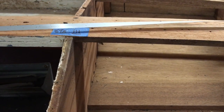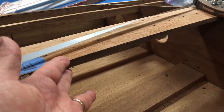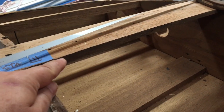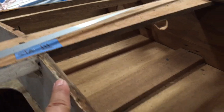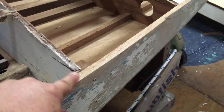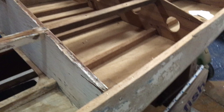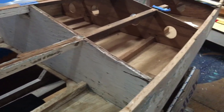The longerons are three-quarter inches thick, about three inches wide. They're cut out rectangular and then beveled to follow the angle that runs down off of the edge. This edge here gets a little bevel too. So we've got stringers, frames, and edges.